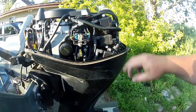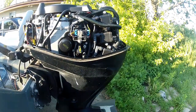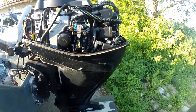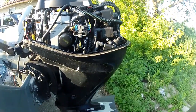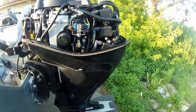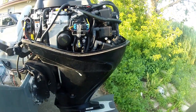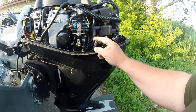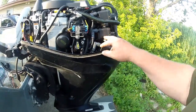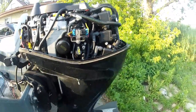That's what's up with the boat. Now I just gotta figure out how much a new coil costs and order one — it's real easy to change. Maybe I'll look for a used one. It's a great motor. My buddy from a couple weeks ago, who's a mechanic, did say it sounded like it had a little miss — he was thinking spark plug, which would have been nice, but I verified there's no spark even coming from the coil itself. Anyway guys, we'll get her fixed and get back on the water soon. Thanks for watching, don't forget to subscribe, stay positive!